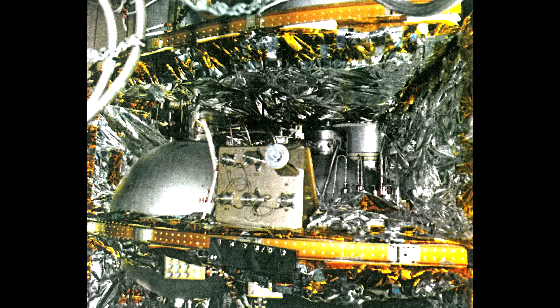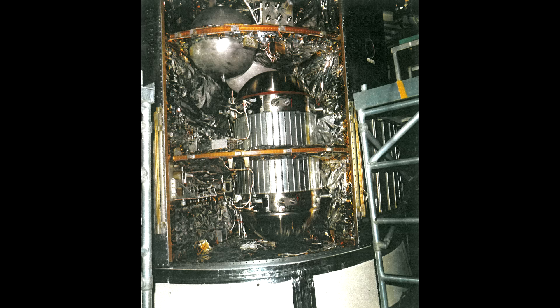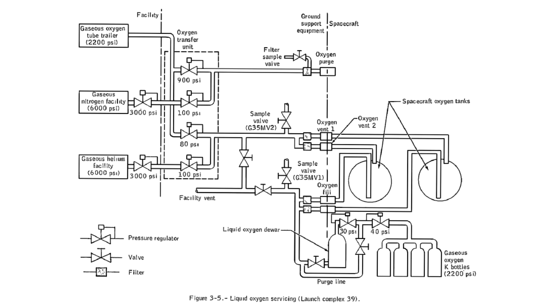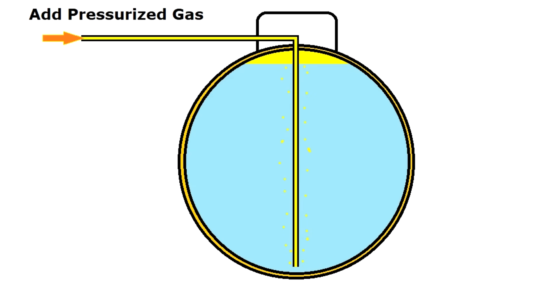So the shelf was removed, upgrades were made, tests were performed, and the shelf was then installed in Service Module 109, which would then be shipped to Kennedy Space Center in June of 1969. And in March 1970, it was going through the final preparations for launch. During the countdown demonstration testing, the tanks were filled to 100% with liquid oxygen, and then later the testing required emptying them down to 50%. This was done by blowing pressurized oxygen into the tank and then opening the fill line, which would drain from the bottom of the tank out the top. So the gaseous oxygen at the top of the tank pushed the liquid down and it flowed up the fill line.